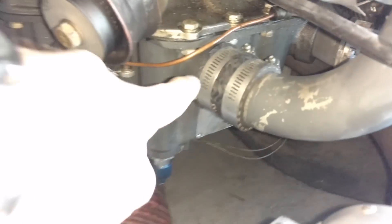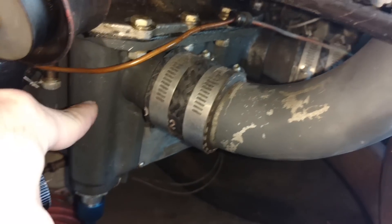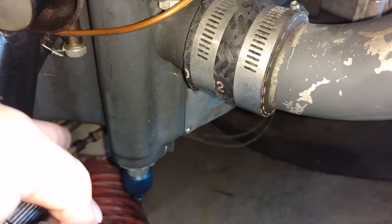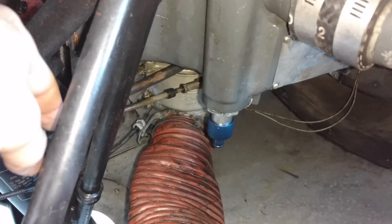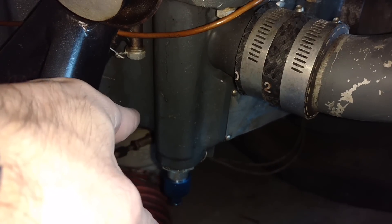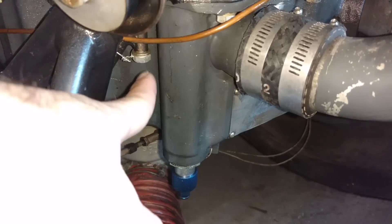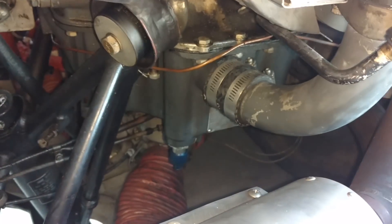These are great little things to check on your pre-flight — make sure they haven't moved at all. This connects the intake tube to the intake that flows through the oil sump. This is where all the oil is kept. This little blue thing down here is the oil drain — when they do an oil change they just open up this little blue valve and all the oil drains out. Because the oil is hot, it actually keeps the carburetor a little warmer than usual, which helps prevent carb ice on Cherokees. Also, because the cool fuel-air mixture flowing through the carburetor into the intake pipes is flowing through the hot oil sump, the air going into the engine actually acts to help cool the oil. That's part of how Piper and Lycoming designed this to help keep your oil cool and ultimately keep your engine cool. So the intake air flows from the carburetor through the hot oil sump, then to the intake pipe, then into the cylinder — the cool air coming in through the front mixing with the cool fuel helps keep the engine cool overall before it burns and makes it very hot.